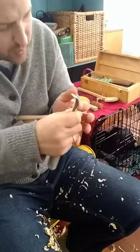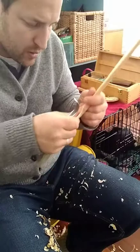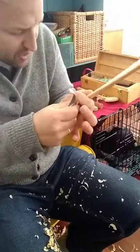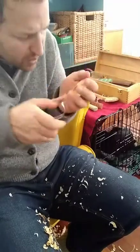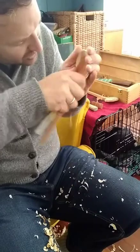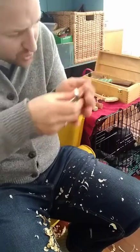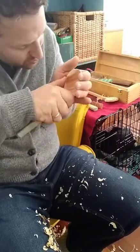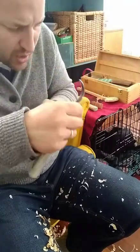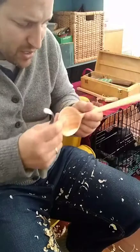Now I'm just feeling for any spots that might be thicker, lumpier, or showing up as slightly torn rather than freshly cut. As they dry out, that will show up easily. The nice thing about cherry is you wait 30 seconds and those marks will show up. So I'm just going around checking.